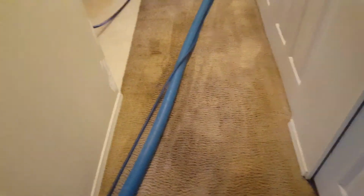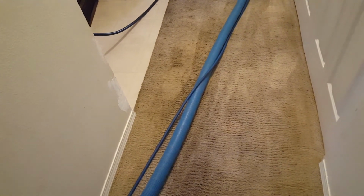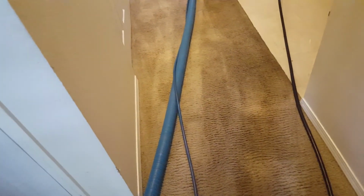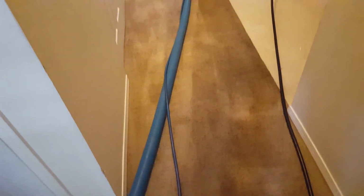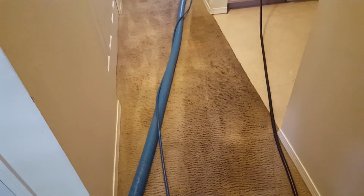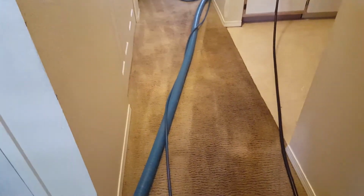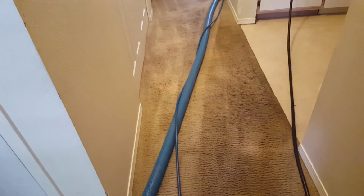This here is a result of polyester carpets that are dead. So there's absolutely nothing that can be done here that I know of. I mean, I pumped up 200 degree heat, water, steam on there, commercial magic. And you can see that wear just looks absolutely nasty and nothing else is coming out. We broke the water tension, we did everything that we're supposed to do for olefin and polyester, and that's the result. And the same with in here.